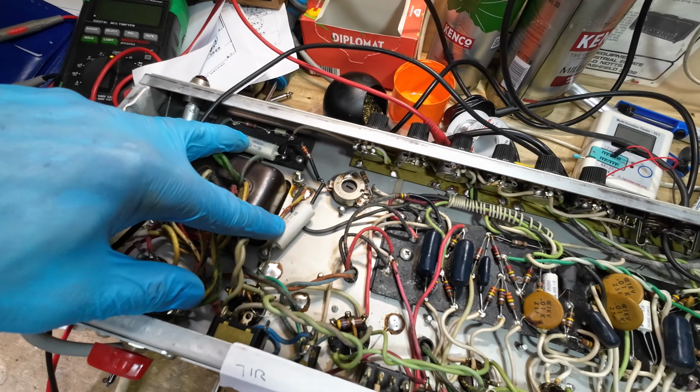if I put the meter on the board, you can see this half a volt there on the board. So put the meter here, 1.3 volts leaking onto the board, 1.9 volts, 1.8, well, that's fluctuating, 1.3 volts leaking on the board, 1.1, we go up here, 0.5, 2 volts, 0.7, 1.4, even on the edge of the board there, 3 volts, 2 volts, whatever. So you can see this board all over is conductive, and that's what's causing the problems.